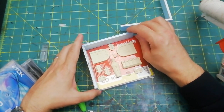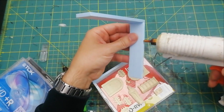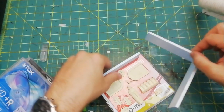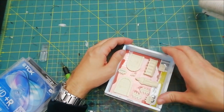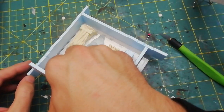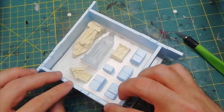Another important aspect is the spacing of the pieces inside the mold. The distance should never be less than half a centimeter to avoid creating parts that are too fragile with silicone. The arrangement of the pieces must also be such as to allow the maximum possible filling, so as not to create empty areas and consequent waste of silicone.